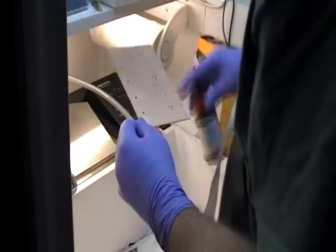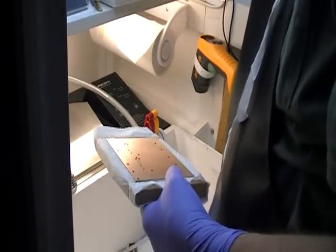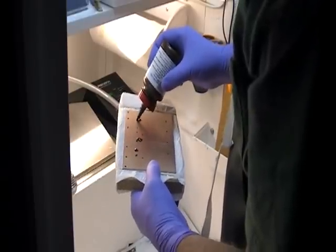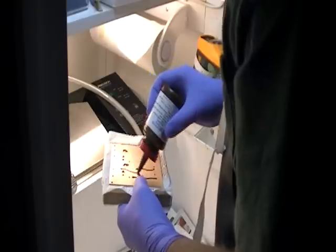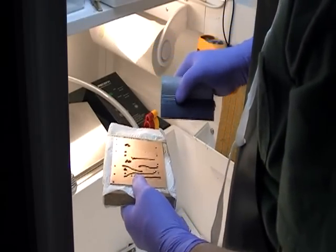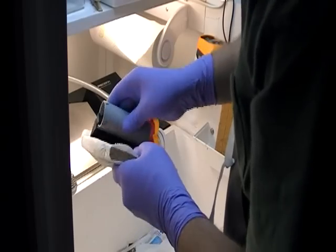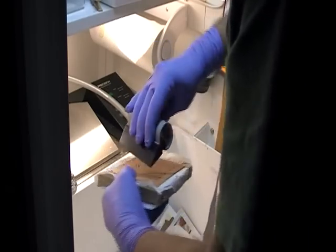We take our clean and dry PC board and take the top off the conductive ink. The first thing I like to do is put some ink down in the through holes that are really big — get a drop in there. This is where the power jack mounts and the USB port mounts on this one. Then I put a couple lines across the board, take the squeegee, and squeegee the ink into those holes. You want a good angle — make sure you get all the holes filled, just work it in there.